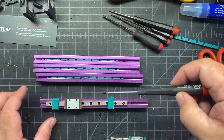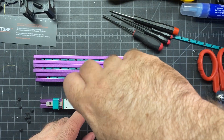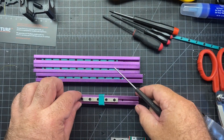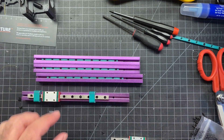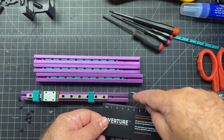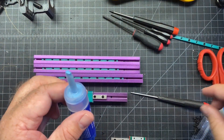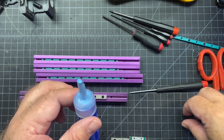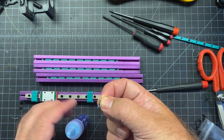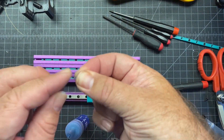I've got the guides in place with the carriage still on and I'm just screwing things in. Before I started screwing things down I also measured carefully to make sure there's 38 millimeters between the edge of the rail and the edge of the aluminum extrusion. For each screw I'm going to put a little bit of this blue gel — it's basically like a Loctite — just a little bit on the tip before you screw it in, which helps keep it from loosening up during vibrations.